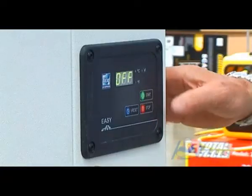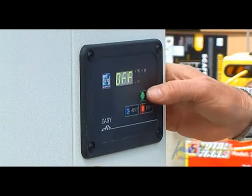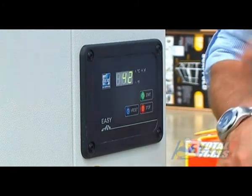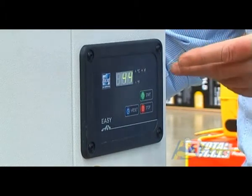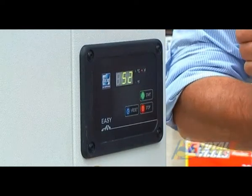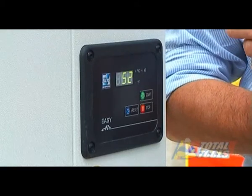When we start the compressor you'll hear the difference in the three stages. Here's the control panel — on-off button. In the field here we can see the oil temperature, currently 40 degrees. The temperature rises very quickly on the silver machines, within two minutes to 70–75 degrees Celsius. This avoids a lot of condensation by taking a short time to heat up.